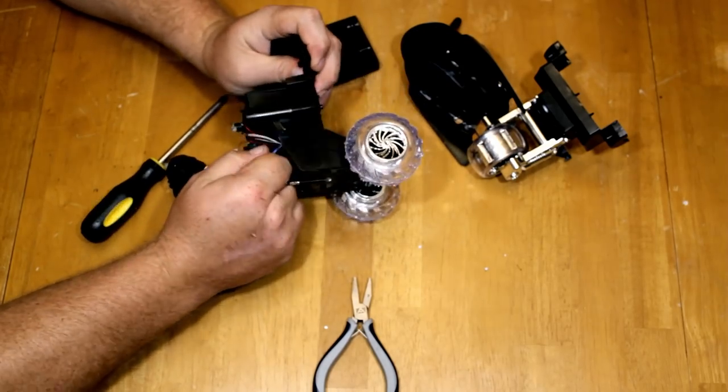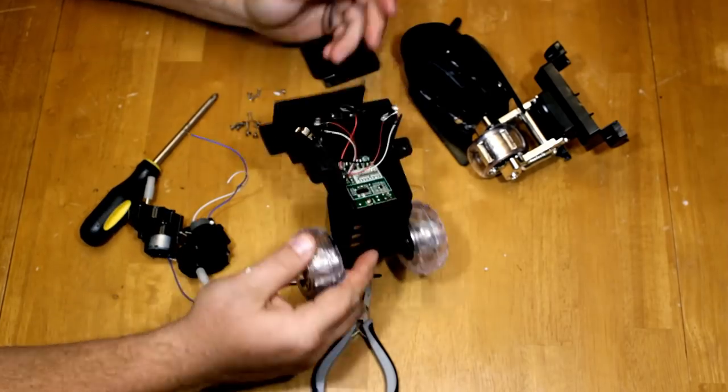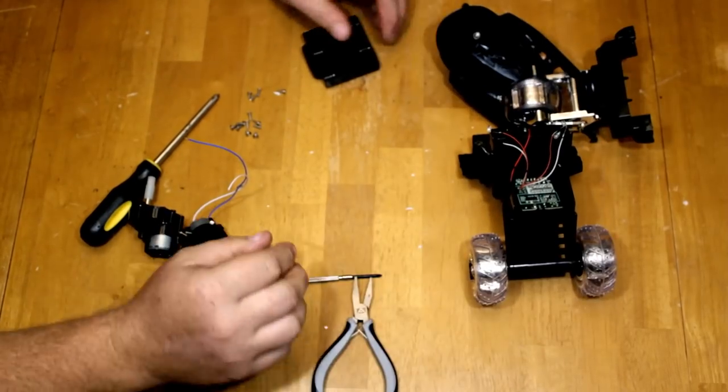It's pretty well geared but you don't want to push it too hard — it's a cheaper DC motor with a plastic gearbox, so be cognizant of that and don't push it too high in voltage. I will include files to use an Economy Gear motor from Servo City as an alternative. The problem with that is you need a high-voltage ESC because those motors are rated up to about 18 volts, so when you're only pushing about 8 volts they don't go that fast.